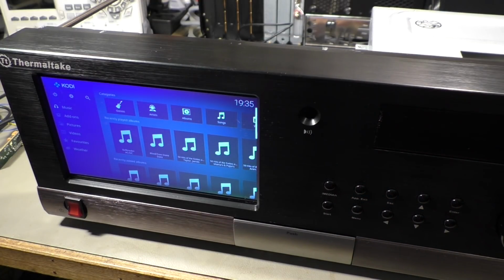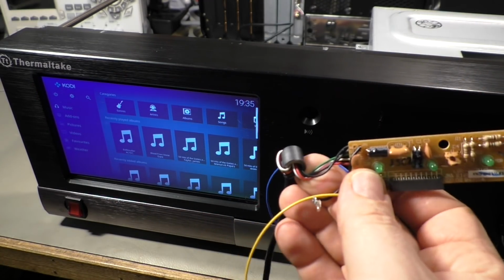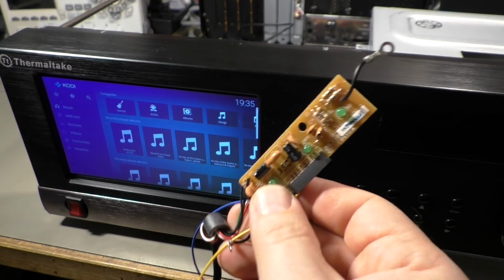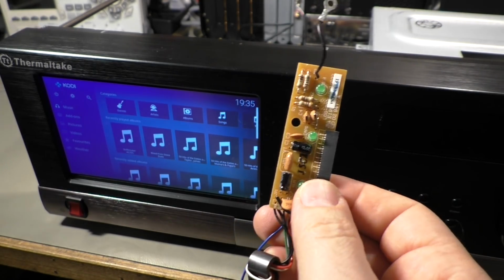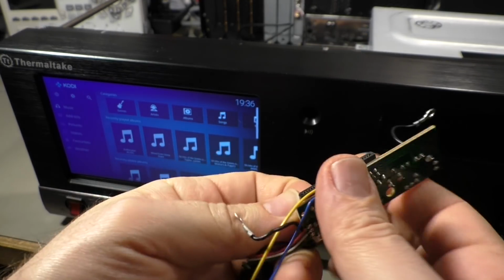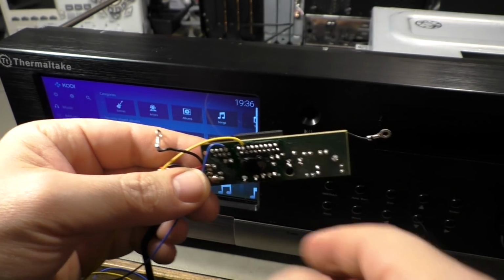So I came up with the idea to cannibalize an old keyboard. So that's a keyboard controller from a Logitech Slimline or extra slim keyboard. I think that was how it's called. I don't remember the exact type, but I think similar keyboard interfaces can be found in any keyboard. Here you see 2 connectors. One is for the rows of keys and the other one for the columns of keys.